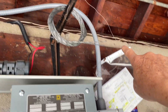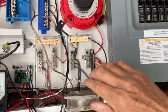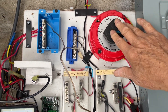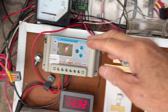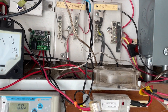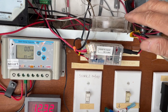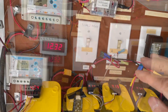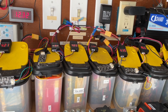The current comes in through here and then gets distributed. This is just a quick shut-off. Basically almost every wire is fuse protected. I also have a cooling fan here which will turn on automatically when the temperature gets warm, providing airflow through these battery packs.